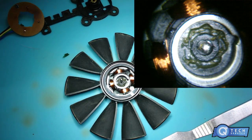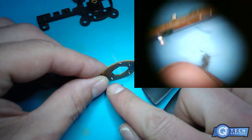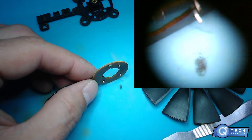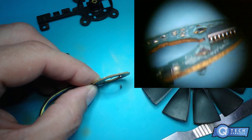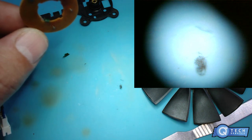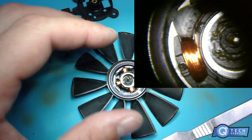So normally when you're pulling up on the fan, it would just bring that washer up. It would bring it up, yeah. But you must apply pressure to the fan. Yeah. You had to. Oh, I did, yeah. Because it was cracked. That fan was noisy for a couple months. No, it's bent here. See these pins? See this pin? I used to get really angry when it was noisy and just be like, stop being noisy, fan. No, wait, you see the pins? They're all bent. Yeah. So that's why it just came out of its socket, because you broke the glue where it sat in. Mm-hmm. So now we just pull this piece out here.